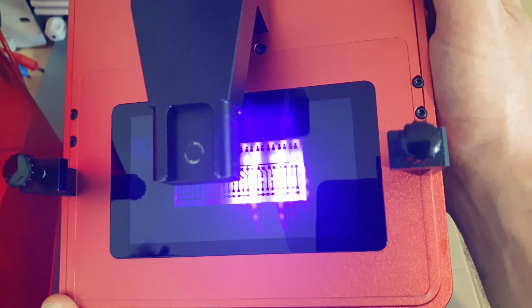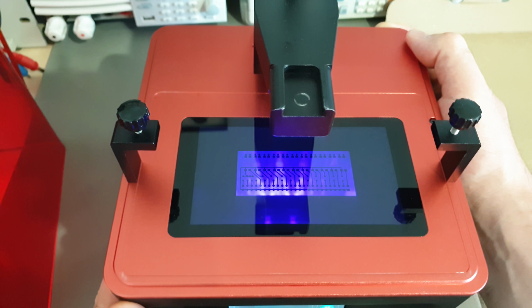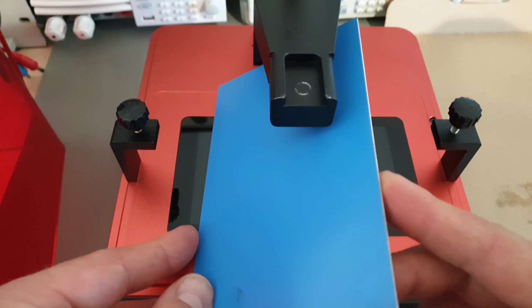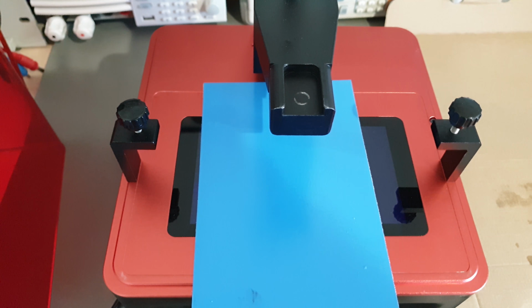So the UV LED in here is a big one. It has an area, and it's not a perfect point source. That means that the shadows cast by the LCD are going to have blurry edges. But the closer you can get the masking layer to the photosensitive layer, the less you'll see from that problem. I'm going to use the standard 60-second first layer exposure time, because that seems reasonably close to what I used in my old fluorescent lamp-based exposure box.